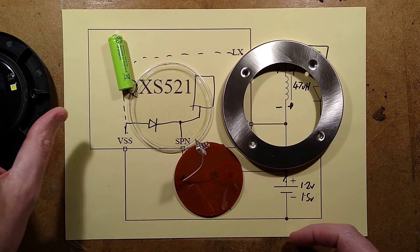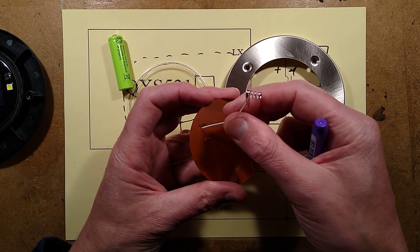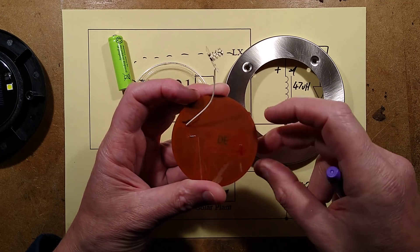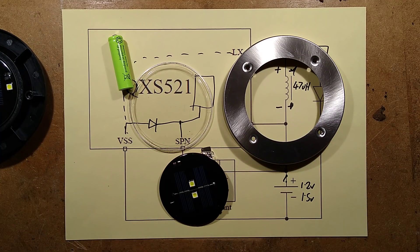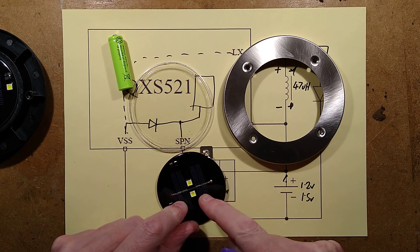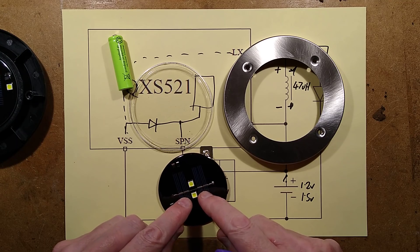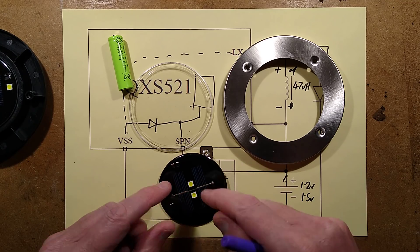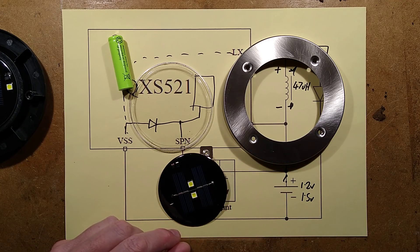That's Poundland's solar light - it looks alright, that's reasonable construction. You have the option of putting a better battery inside, and it looks okay. Just be careful when you take it apart as you can snap these wires. Poundland's solar garden uplight - it's very simple. It's nice that the electronics are mounted under the resin which protects them. There's no separate circuit board - all that's on the back is the switch, which can be shorted out since they're unreliable when water gets in, and the battery which is fully accessible. It's a very serviceable-looking light.